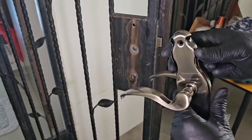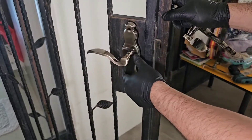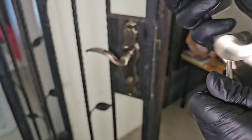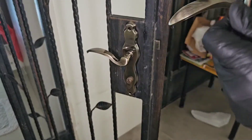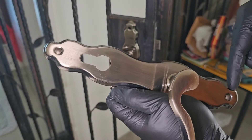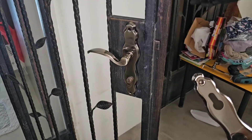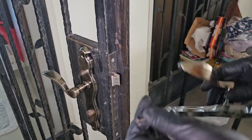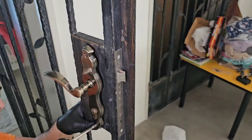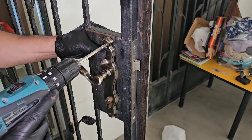Make sure they are facing in the right direction. Put the cam on first on this side, slot that in to your new lock. On this side you have these two screws — take it out and that goes on this side. What you want to make sure is the handle on the outside of your door does not have any slots where you can put a screwdriver in. The Phillips slot is on the inside of your door — so this will be inside the house, this is the outside of the gate. The outside handle does not have any screwdriver slots. There you go.